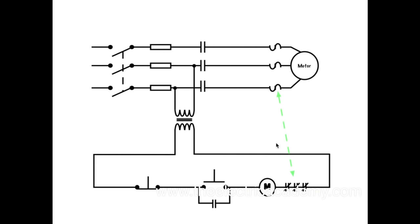So that kind of opens up the control circuit. When we look at this, here I've got these are the heaters right there, and right down here are the contacts — they're attached to each other. So when these guys open up, these guys trip.